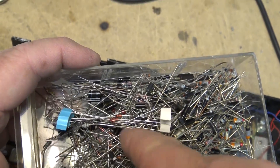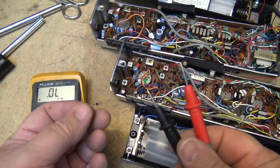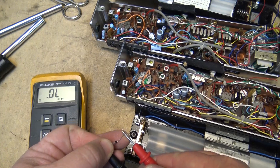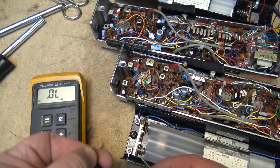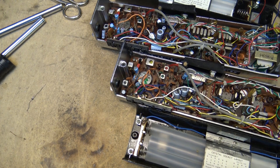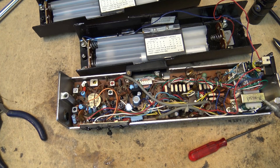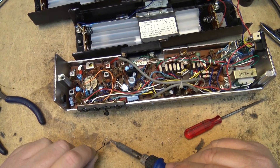I've got a big pile of diodes and I'm sure one of these is going to be a germanium glass diode. I have one here — we'll test it and see if it's any good. First we'll test it in the reverse direction: it's open, which is good. Now we'll test it with the negative on the cathode. It's germanium, so it should be about a 0.2 volt drop, in contrast to silicon which is typically a 0.7 volt drop. And there we go — 0.243. So this is a germanium diode, used as the detector in AM radios. This one's good. So let's look at the orientation from the original unit and then put it into the other board and tin the pegs and the new part going in.